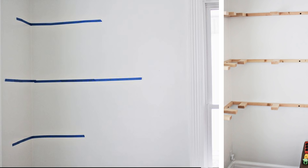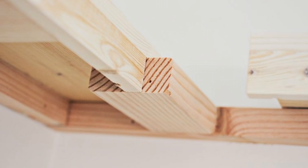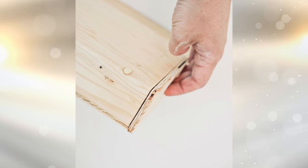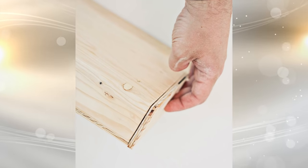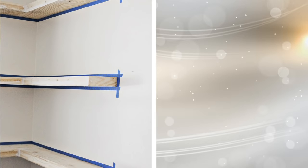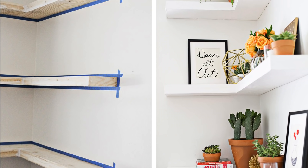Start at the bottom and work your way up. You can screw or nail those on, and hopefully your walls are nice and square. Screw or nail on the underside and end pieces. Putty any nail or screw holes. Tape the wall if you're going to paint another color. Once you paint, you're done — time to put your stuff on display.